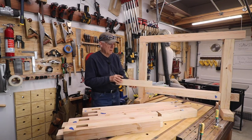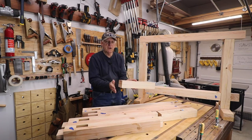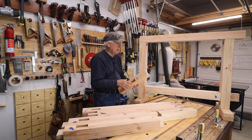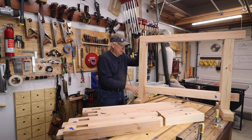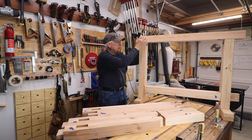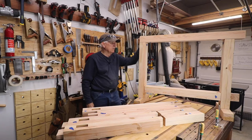I'm going to do some shaping of the edges for looks purposes, and I'll certainly do that before the glue-up. I'm going to get the main body — everything except for the feet — glued up together first. That will allow me to come in and cut the dovetail grooves after the pieces are already joined, so I can run a dovetail groove perfectly straight all the way down when it's all assembled.